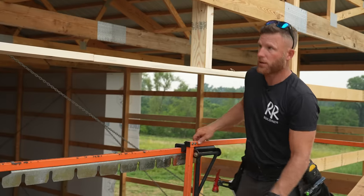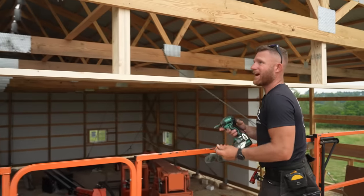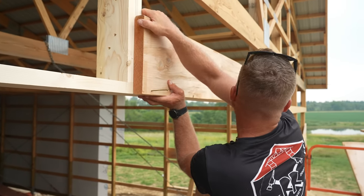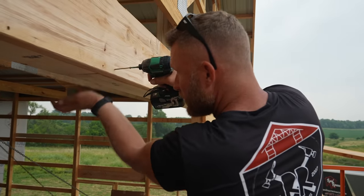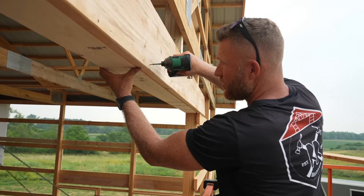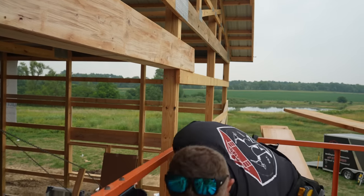We've got these 2x12s and we're going to come from the middle here and go both ways to create just kind of an outside frame. We're going to flush up the bottom of this header. This is that splice I was talking about — you can see why it doesn't really matter that it's in a kind of wild place, because we're going to be doing a 2x12 inside and outside. There's nowhere for it to go — it's basically a stiffener inside that header so it doesn't flex around. Now we're going to go ahead and run some real nails through this into these stub columns.